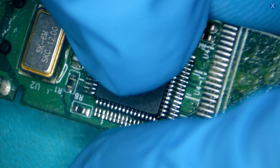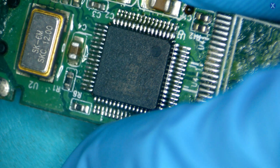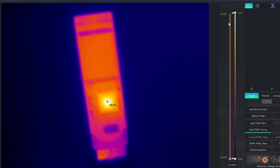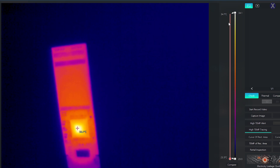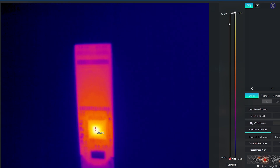Let's plug in the thermal camera. If we see this light up, when you get good power and good lines that means you don't have a power issue or a connection problem — it means you have a controller issue. Let's take a look while it's plugged in. When we see something like this, that means the connection is actually okay but the controller is a problem, because the controller is getting warm but we don't have access to anything else. This is a clear indication the controller has a problem.